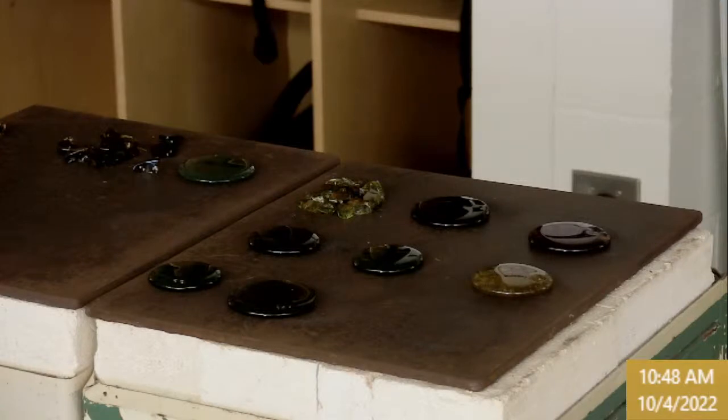The way to view this is that there's a giant glass furnace up on the ground floor, and then all this factory is built in the basement. Basically a giant pool of glass with tapping spots on the bottom. What you'll see is it's dripping this glass through by gravity, and then it will pinch these blobs of glass, which then fall through dies. They use gravity, really smart the way they got this set up. As the glass falls through dies, it's sort of like the way you draw wire through dies. They've got larger and smaller dies, so it funnels it into the right shape.